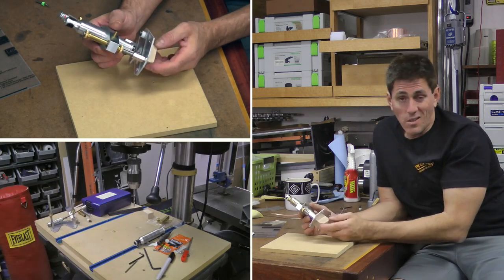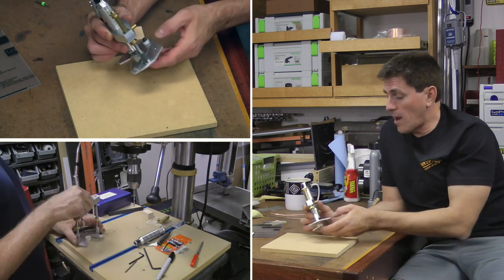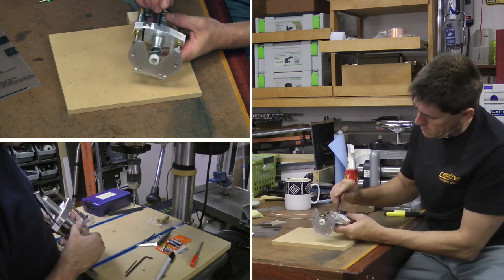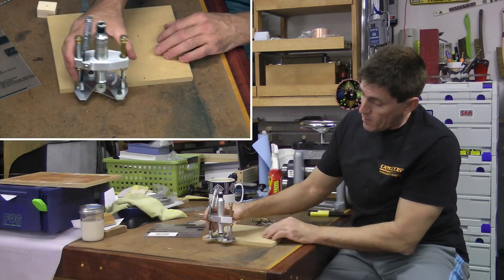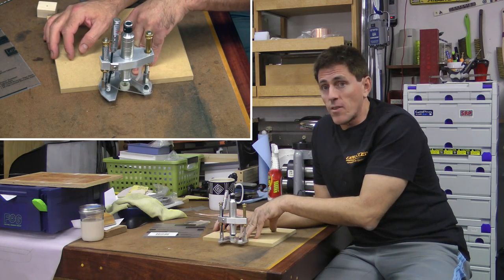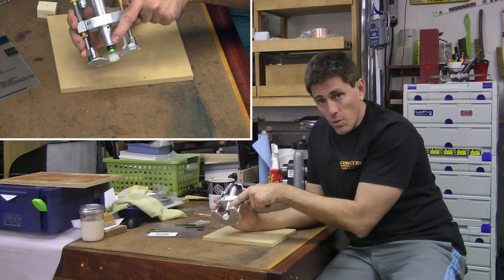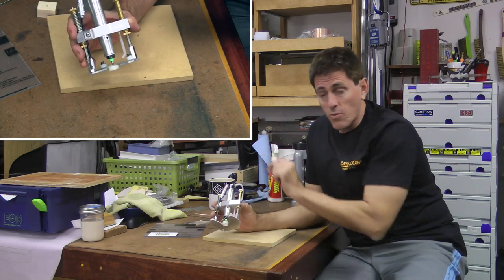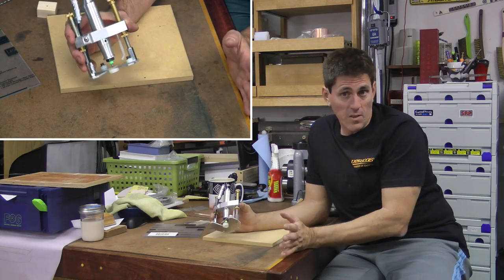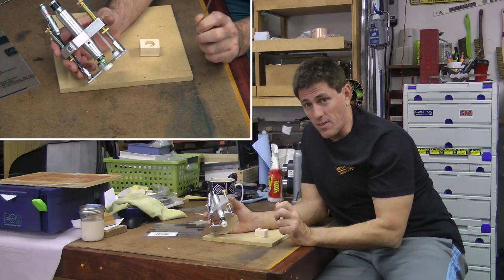It's a really easy thing to do with this Lexan and it's going to be very useful for me. Now with this base, I can swap out the bit for one of my inlay bits and follow a pattern very easily using just a piece of quarter-inch MDF that's been shaped. I can get enough bit projection by lowering it down far enough to do the inlay for my wire. Simple jig, didn't take all that long to do — took longer to explain. Stay tuned for Angle Madness when we inlay 35 feet of this stuff.